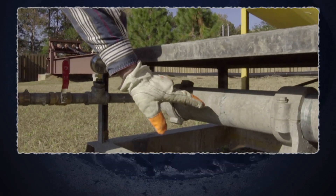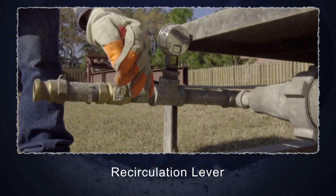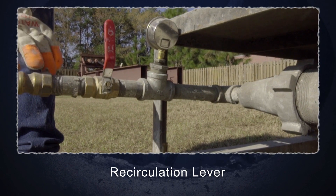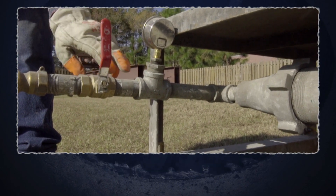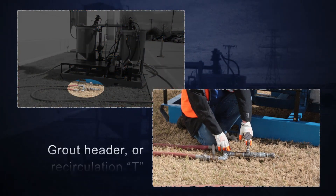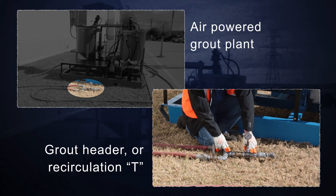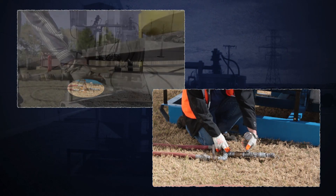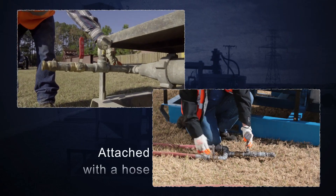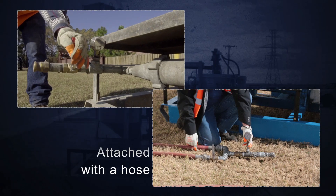The piping here is one feature that you will see on different plant types. This lever can be used to throttle the flow of grout to either recirculate the grout back to the agitating tank or send grout to the tendon. A similar recirculation system, also known as a grout header or recirculation T, is shown on this air-powered grout plant. The previous grout header was attached directly to the plant; this header is attached to the plant with a hose so that it can be placed near the tendon inlet.